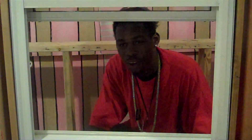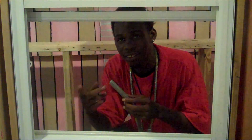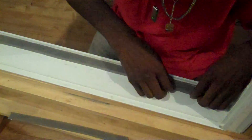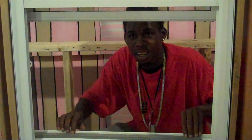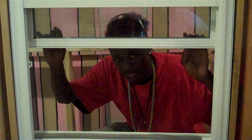With weatherstripping, it's very simple. You take your weatherstripping, cut it to the size that you need it to fit, and all you do is peel and stick. But you want to make sure that it is under the window itself. That way you get a nice tight shut every time.